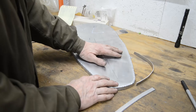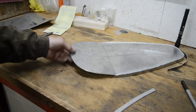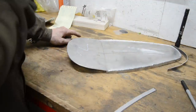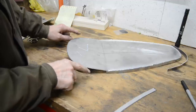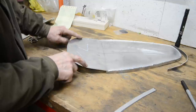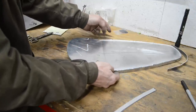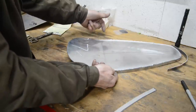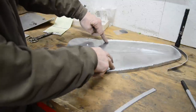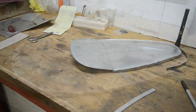And also, I've noticed actually that the, see if I've got you still in. Yep. You know, I was going to make a couple of knee pieces, a couple of L's, to go onto the rear suspension unit tops. Well, the rear suspension units are right back here. You'll see when I put it on the frame. But here is where the gusset is on the top tubes of the frame. So what I might do is drill through them, sleeve them, and put a bolt through and mount it, make the mountings forward here. So anyway, let me go and weld these pieces onto there.